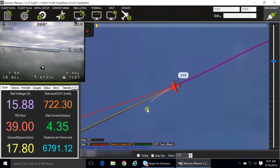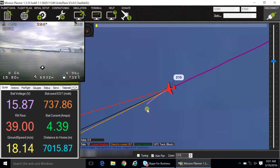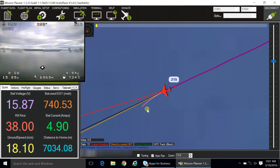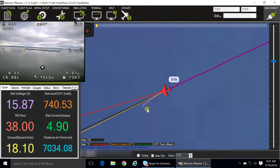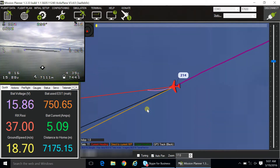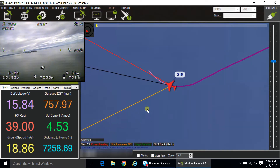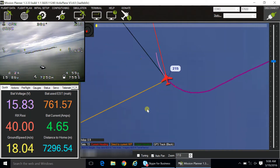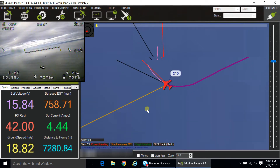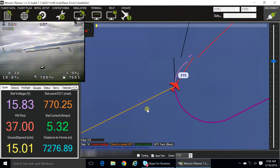When I initially purchased my TBS Crossfire system last year, I bought the tuned antennas as well, but I never intended to use them as antennas for the telemetry modules of my Pixhawk. I found out later that they're both using 915 MHz, so I said might as well try it and see the performance. These two antennas are basically dipole antennas tuned and sold by TBS Crossfire.